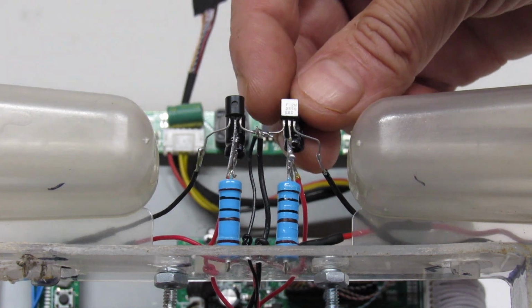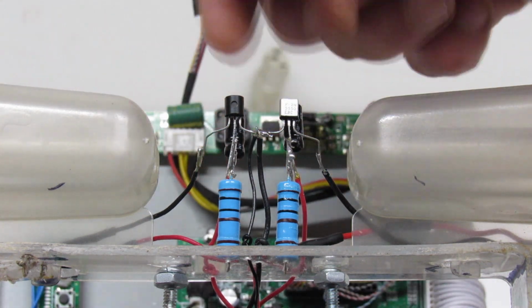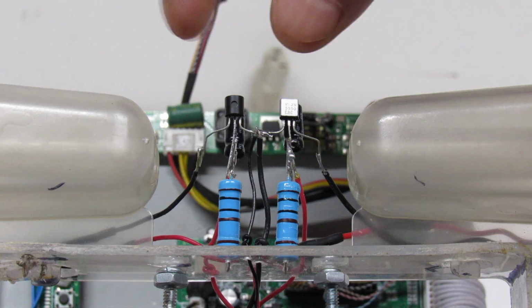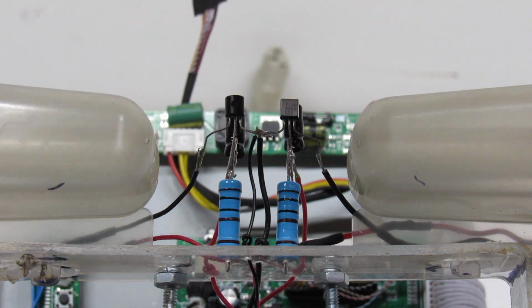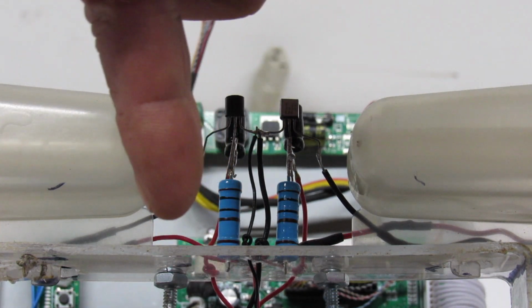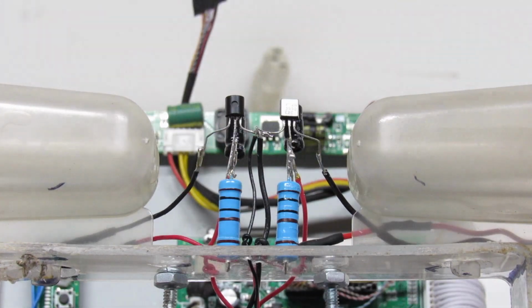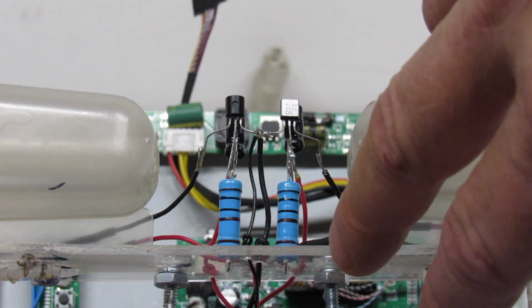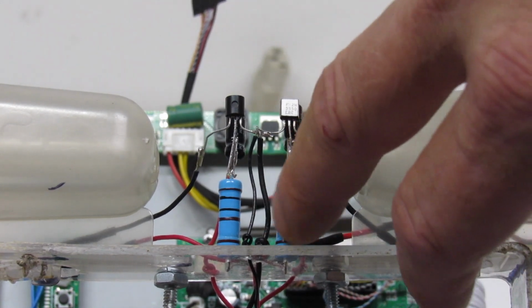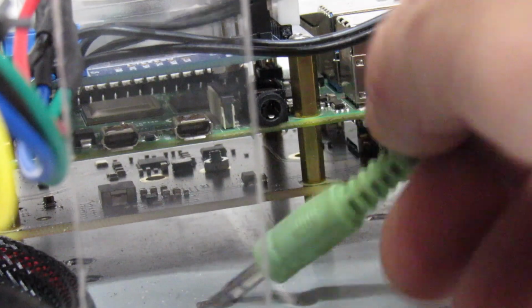Okay, here's a nasty little audio amp circuit I built. I mean that, it really is nasty. But you know, I was working with what I had on hand. I had a couple of capacitors, some NPN transistors, and these 1K resistors. When I initially built this, I used some 1/4 watt resistors, and they got so hot, I thought they were going to burn through the acrylic or melt through it and continue to the Earth's core. So, in order to save my project, I went ahead and put these 3 watt honking resistors in there. And it is amazing what effect it had on sound. It actually got crappier. I didn't think it was possible. So I'm going to have to do something with that. But it does look cool, and that's really what is important, isn't it? Oh, and for audio to work, I guess we should go ahead and plug it in.